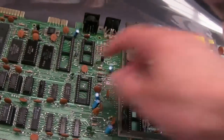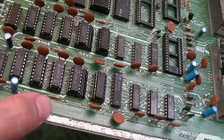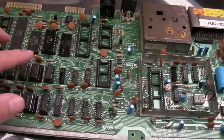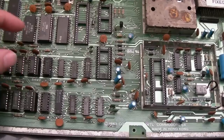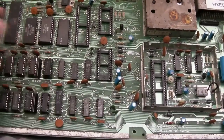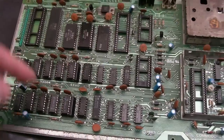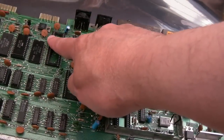So, yeah, what was the actual fault? The kernel. And obviously someone wrenched that off. It was 1K, and obviously I socketed a few things here, three things that didn't need to be socketed. I was on the track of thinking these were the faults when they weren't, because I was following the issue, but didn't realise it was that resistor. And obviously there were some broken traces here.